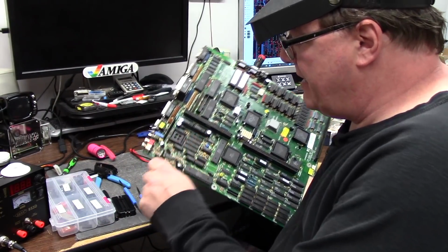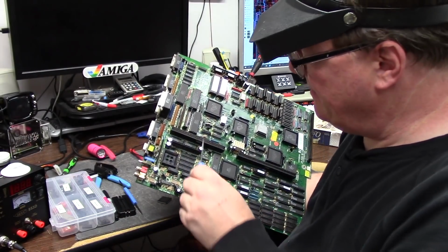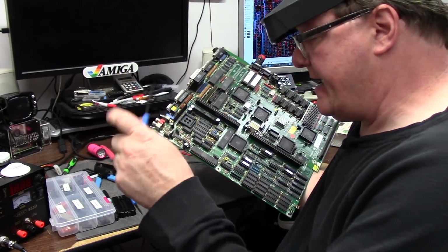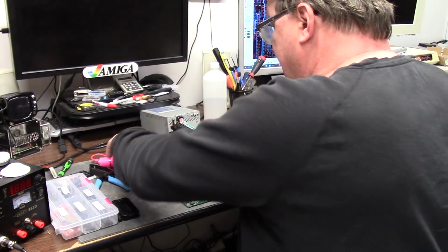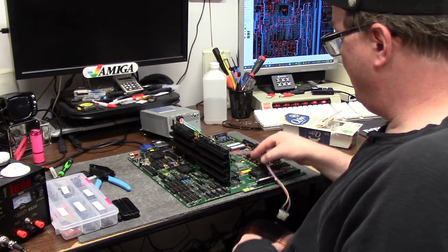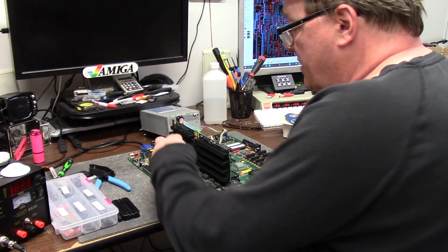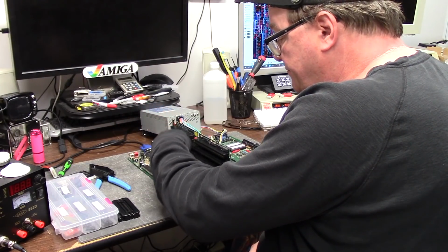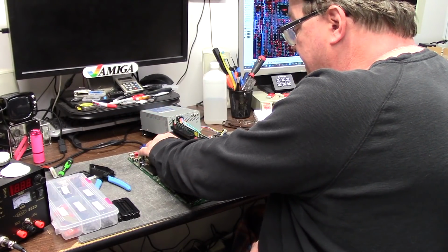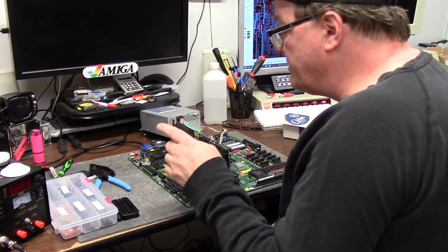So in the meantime, I have gone through and lifted all of the pins in this socket to make them hang out again. I don't know, I'm at my wit's end. Brought it back from the dead. It was totally dead. A lot of rewiring, a lot of sockets, a lot of cleaning. Denise soldered to the board because it was so crappy. RGB works, both vidiots are working, everything pins out. Unless it's a bad buffer chip, I don't see how.